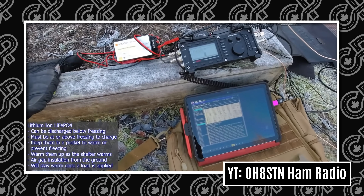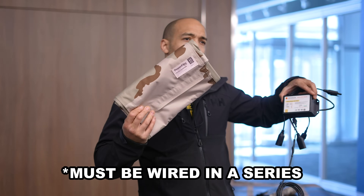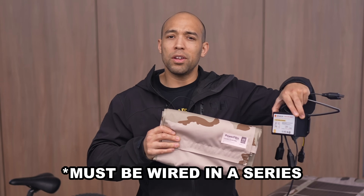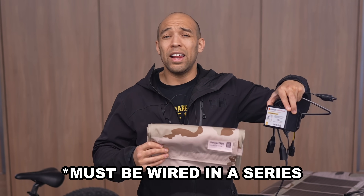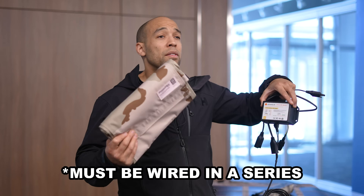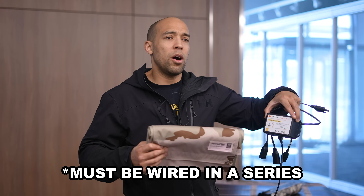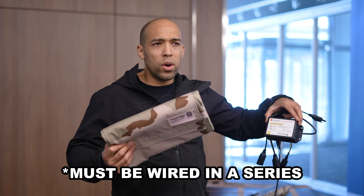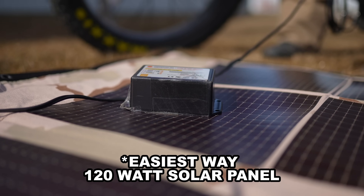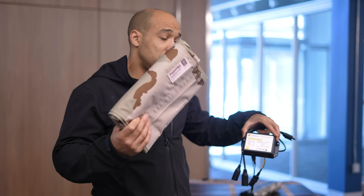My buddy over at the Survival Tech Nord YouTube channel recommends two 60-watt solar panels. This boost controller takes your 15 volts from the solar panel and turns that into 54 volts. Without getting overly technical, what this means is that it has to reduce the overall amperage. So if you double up on the solar panels, that's going to increase the overall amperage and thus increase the amount of power going into your e-bike battery. You can do it a couple of ways: get a 120-watt solar panel, or get two 60-watt panels — he recommends two 60-watt panels.